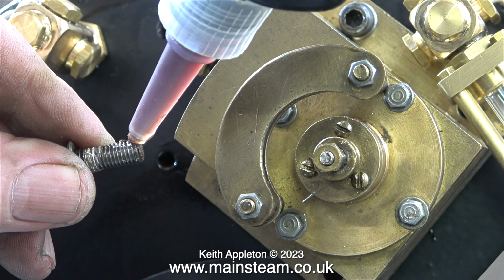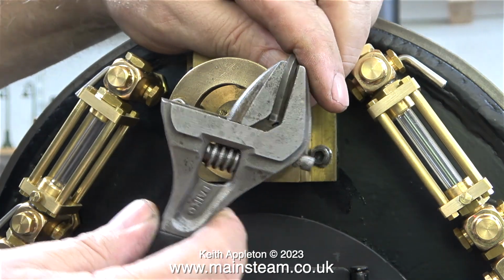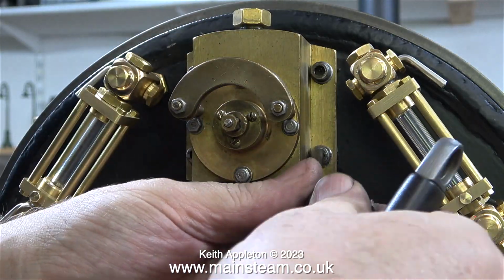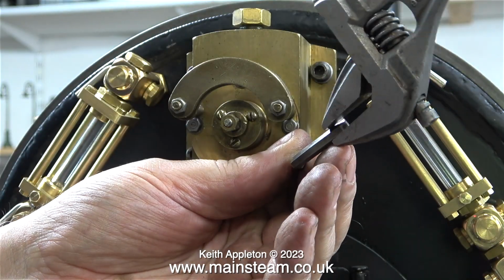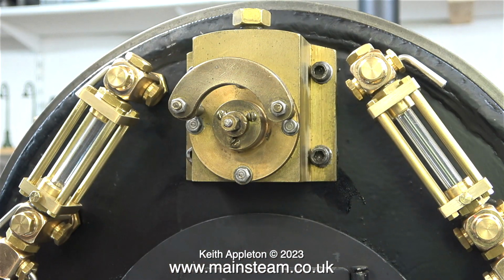The fittings on this steel boiler screw straight through the steel boiler into the steam space, and for that reason, I'm making sure that the threads don't leak, so I'm coating them in something called Bond Lock, which is very much like Loctite 542. It's a hydraulic seal. And hopefully when I test the boiler, there shouldn't be any leaks around the bolts or the fittings.